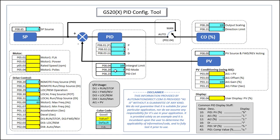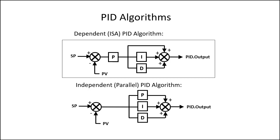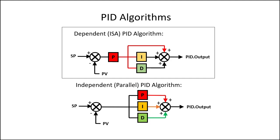Notice that the GS20 gives you a choice of two different PID algorithms. In the dependent PID algorithm, changing P changes I and D — that simulates the old analog systems where changing the gain of the system changes everything else too. In the independent PID algorithm, P, I, and D can be tuned independently without affecting each other, which makes it easier to tune because messing with one coefficient doesn't change the other two. This is what you'll find in most modern digital systems. We're going to use the default, which is the dependent PID algorithm.